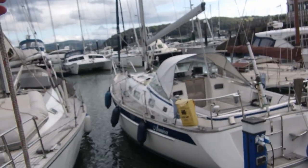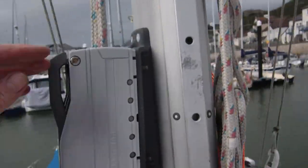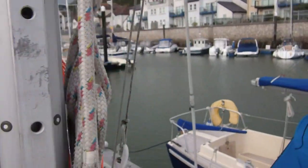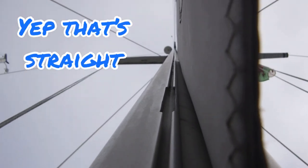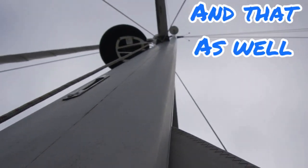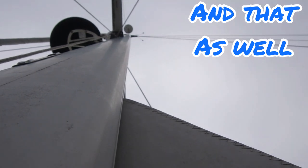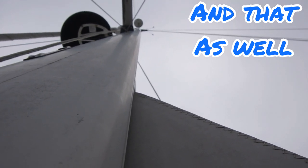The other thing I'll be doing is looking up and down the mast track as I do it - sideways on the mast and the track itself - to ensure that the mast stays straight while I'm doing it. It's easy: just get your eyeball on the track and look straight up it, and you want it to be straight all the way. Please note though, some sporty masts require pre-bend and some even require rake, so check out what your statistics are before you start.